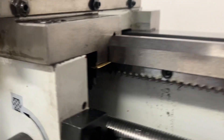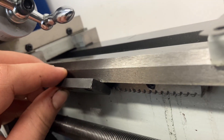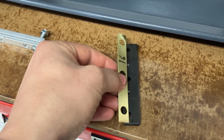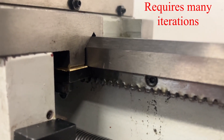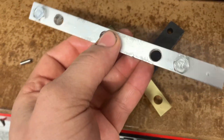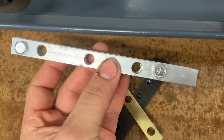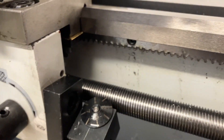To begin with, we're going to look at the saddle retainers. From the factory they will be at an angle — this is extremely exaggerated but you can see they don't sit flush. What I've done is added brass shims onto these and I get the perfect stack so that once I tighten those allen heads on the bottom it goes to the perfect tightness, and I've done that for both sides. I bought some shim stock that's a quarter inch wide at my hobby shop and made a drill guide out of aluminum. You drill the holes, clamp it, and then you can easily drill through the brass without mangling the edges too much.